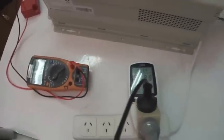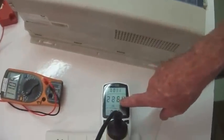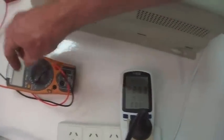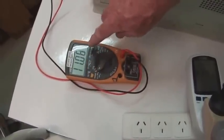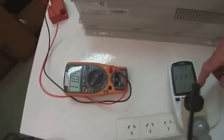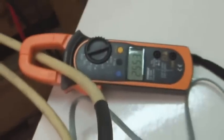Even though this is a 2000 watt inverter, we're going to increase the power more. We've increased the power now to 2261 watts. Battery voltage is down to 11.05 volts. Input current is 255.6 amps. The unit is still running perfectly.